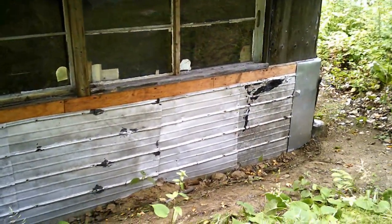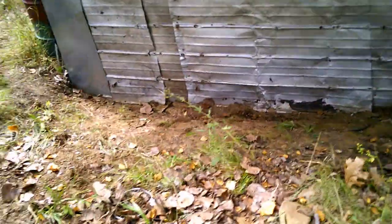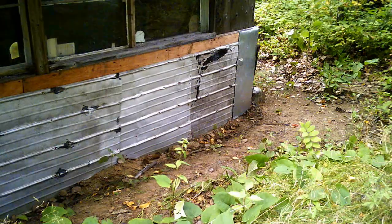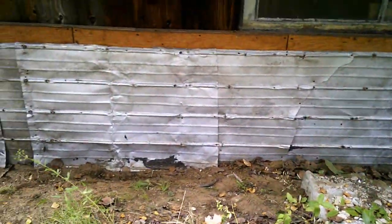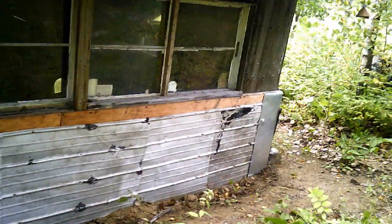So what me and Dad did is we got some 2x4s and plywood, and I reframed the bottom half of the wall, 3 feet up from where the bottom should have been. The bottom edge is now reburied because the dirt and stuff has settled. I wanted to keep it sealed off, so I raked a bit in there to seal it off some. But then of course we put the plywood on it. We fastened the new framework right to the outside of the existing wall, so it's got brand new studs fastened in there all the way down the full length. It's a 20-foot wall.